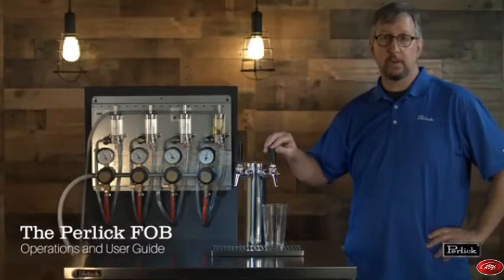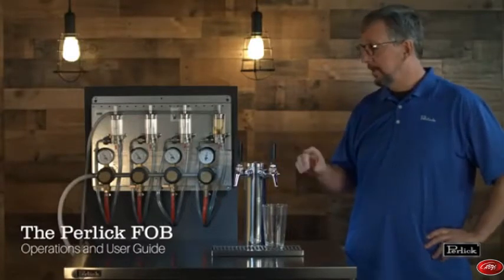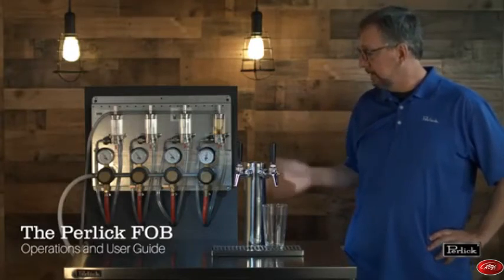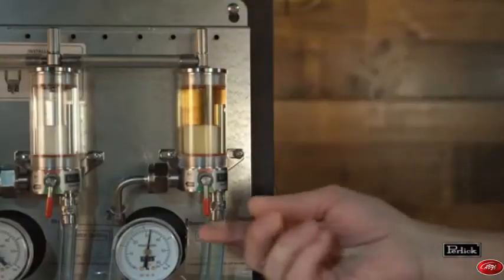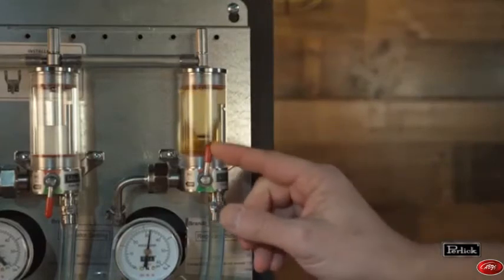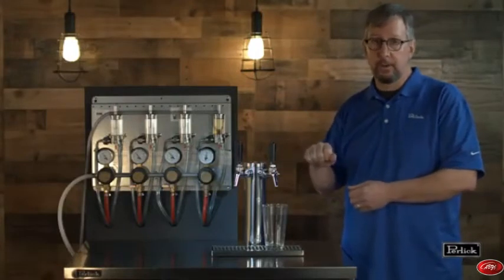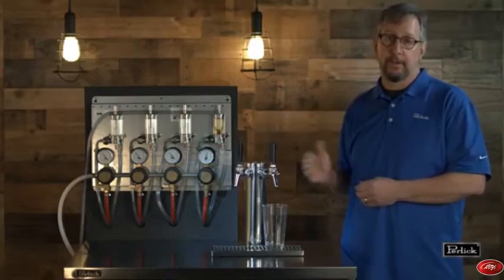We plug the other end of the line at the faucet, so we need to quickly and positively close the faucet. By doing so, we'll be able to go back to our cooler, tap a new keg, fill up the fob, vent the fob, and dislodge the float. Now we have one solid column of beer between the keg and the faucet, so we get full flow of beer when we open the faucet — no foamy bursts, no gas, just straight beer flowing out of the faucet uninterrupted for another keg.